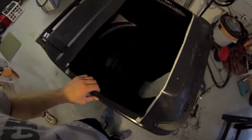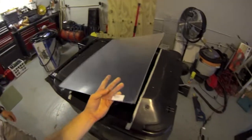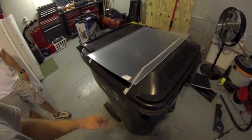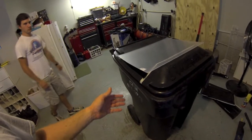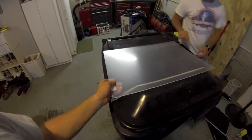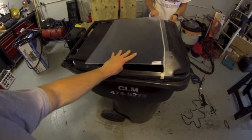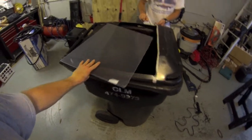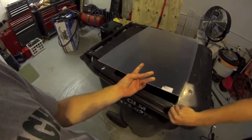We've cut out the hole for our plexiglass. When it's mounted it will look like this. When you put the plexiglass on, because these were the two flat areas, it's going to rest at a bit of an angle. We cut a little deep, but it's okay because we don't want this turret to be indestructible — we want people to be able to hit someone if they're hiding behind it. That's a pretty cool shot if you're able to make it. Plexiglass is a little bit pricey, but if you wanted to go all out, you could cut along the rim area for a more flat surface to screw it on along the sides. Next we're going to drill holes into the top and the plexiglass, then bolt it on.